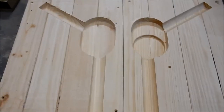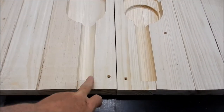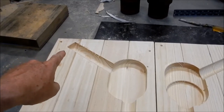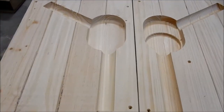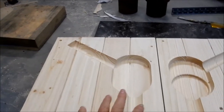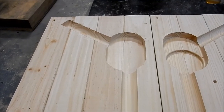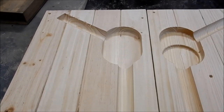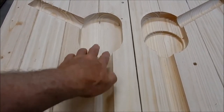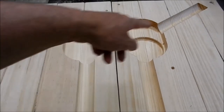There are other ways that you can create the cores from this. I can cut these through down here at the bottom and also at the top, put the two halves together and then ram the sand through the bottom and through the top and create a solid single core. That works out really well, but sometimes they're a little bit hard to get apart. Because these sticks, if you like, are so long, I may put some reinforcing bars in there to give them a bit of stiffness.